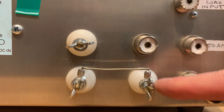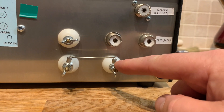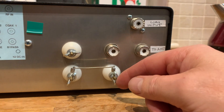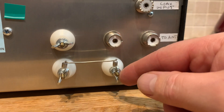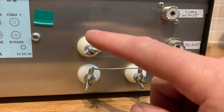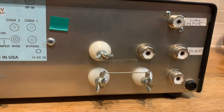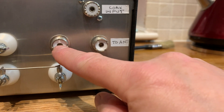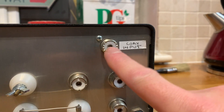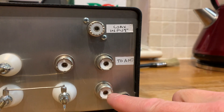If you've just got a single wire, this is where you would connect it — you take this bridge out and connect the single wire here. That's a long wire antenna that would run 40 or 50 meters down the length of your property. You then short that out against this one, so these two become the balanced line. This is where you'd put your ladder line across these two. That is coax number two and that's coax number one — the input from your transceiver or amplifier.